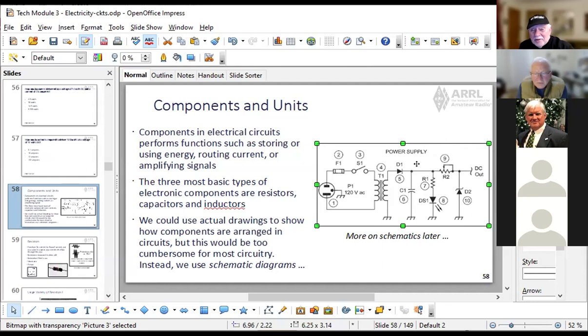There are different kinds of diodes. Like this one sort of acts like a resistor. If the voltage gets too high, it will act as a resistor and try to bring the voltage down. It's called a Zener diode. This one, you can see these arrows coming out. It means it is converting electron flow into photons, into light beams. We have others that will do just the opposite, like the solar cells, which take light and convert it into electron flow. Instead of using a chemical agent, it uses energy directly from the sun.